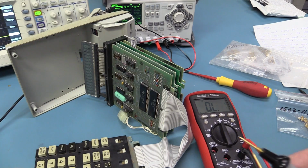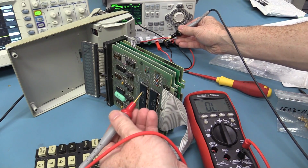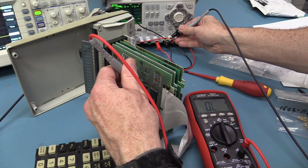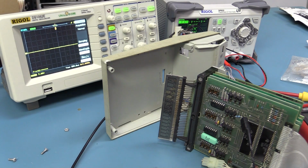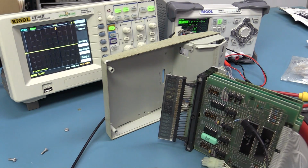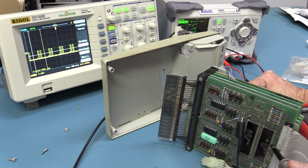And by the way, if you want to know what a good quick continuity buzzer is, this one's pretty darn quick. If you're scanning for ground pins to find on this top board, for example, yes, it's powered down, we can swipe along there like that. Bingo, until we got one right on the end. We got ourselves a ground pin right there. So I just soldered myself a little ground test point there. I've got a resistor just hanging off there. It's a bit bodgy, but it just allows us to get in here and probe around. And look, we got some activity there.